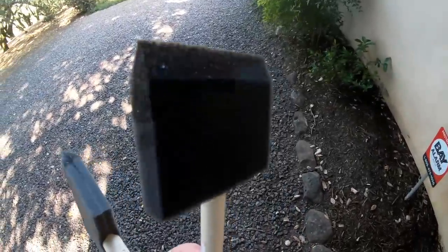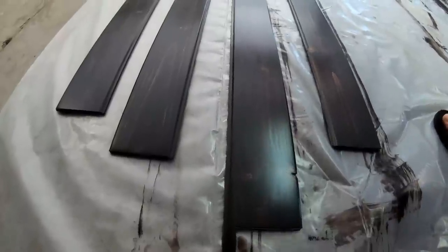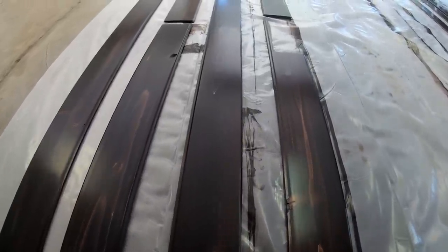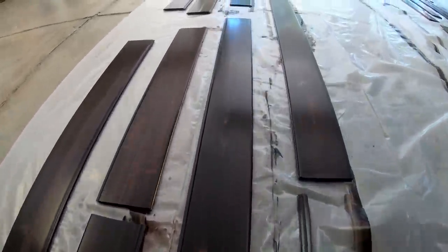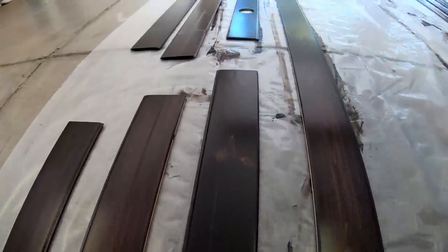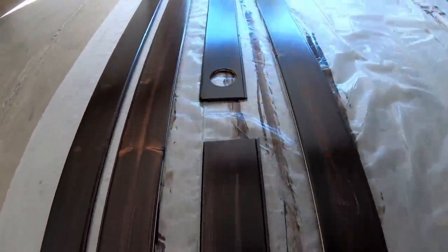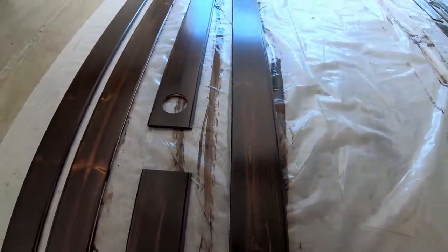The cheap brush is very flimsy and you have to lay the polyurethane on thick for it to even stick to the wood at all, whereas the sturdier brush allows you to put just a very thin, equally distributed coat. So buy a brush like the sturdier one for your polyurethane coats and you're going to end up with a much better finish. With that more expensive brush I was able to get that final bit of perfection — the finish looks really glossy and smooth, it almost feels fake that's how smooth it is.